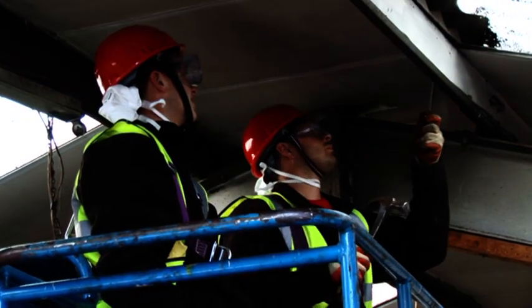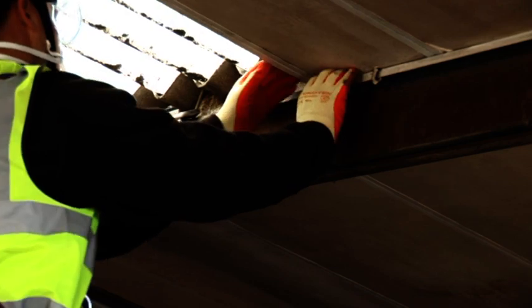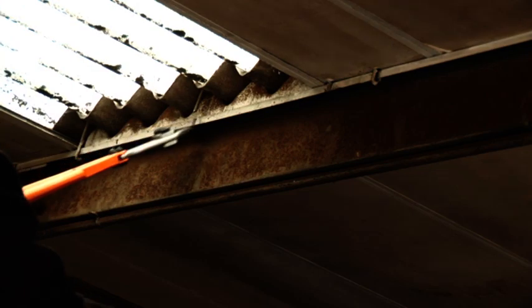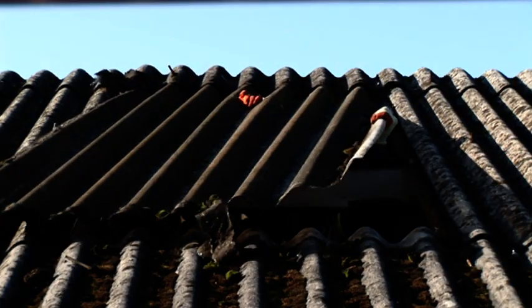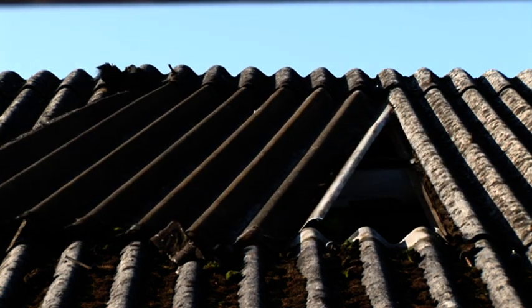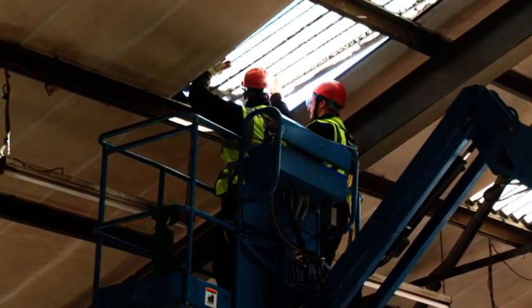After measuring the old fixings, all are removed safely, ensuring that no external pieces can roll off steep pitches. If a roof light is being replaced, you could cut out its centre to retrieve such fixings. Once the old sheet is unfixed, it can be slid down the slope until clear of the overlaps and then retracted into the building.